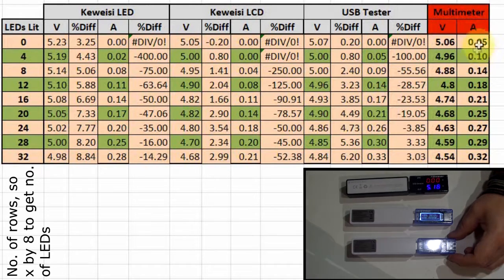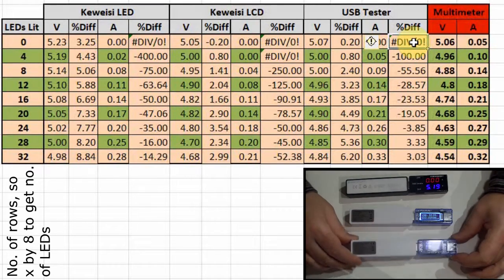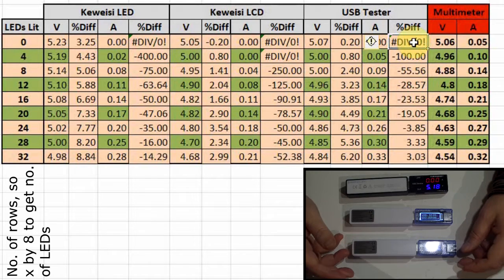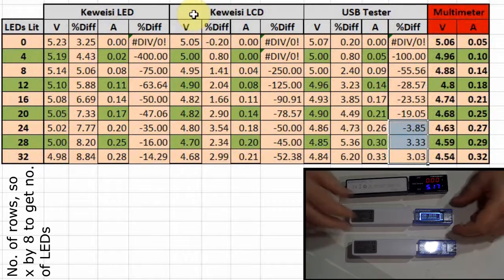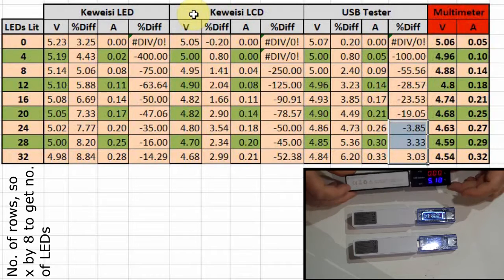Certainly for Arduino projects where we tend to be measuring very low currents, they're all actually fairly useless. Most Arduino projects will be at very low currents — we're not lighting 256 LEDs at once. So you're best off doing what I did: open up the USB cable and take accurate measurements with your multimeter if you want to calculate how much current is being used over a given time to calculate battery life for a battery-powered project. For higher current usage, the USB Tester unit is the one to go with. If you want voltage accuracy, the LCD unit is the best.